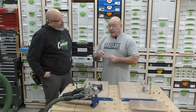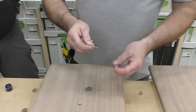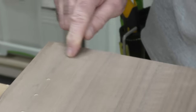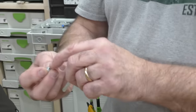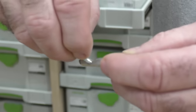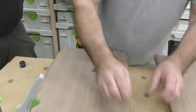We've got to plunge an eight millimeter mortise to accept this piece. It's basically a wedge anchor — when we push this in and put this post in, it will spread open and anchor in here on the vertical side pieces. The whole domino connector system is based off this little tapered recess. Because of the 28 depth measurement, on the other side — the shelves, tops, and bottoms — there's this little hex that's conical, and when it finds its equilibrium it draws the whole piece together. It acts kind of like a draw bore. It's a very well thought out system.